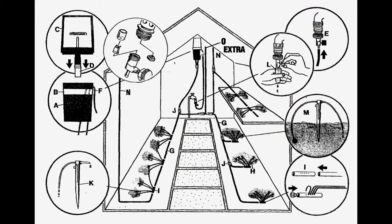I'd now like to show you a typical installation. We have here the greenhouse and in the back, the hydromat. The hydromat should hang from 1.5 to 2 meters high. You see the valve, which then goes up and fills the mixing vessel. And you see the feed tubes going down here along the ground. You can also have feed tubes not just at the ground, but also on a shelf. To do this, it's necessary to have these vertical tubes — a feed tube placed up at the same height as the hydromat. We have one here and also one at this end, to enable a second level of drip tubing.